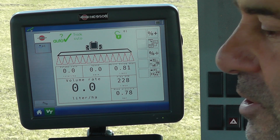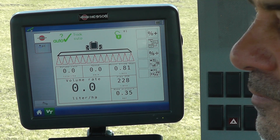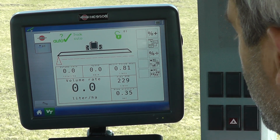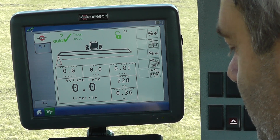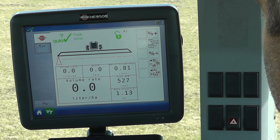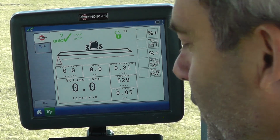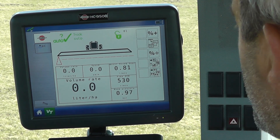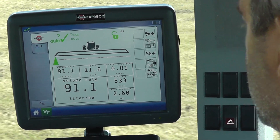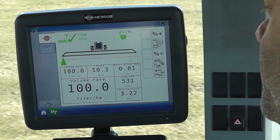For the last test I'd like to provoke the whole system by changing various things. I've stopped the tractor, I'll switch off all but one section, and I'll change the engine RPM. So I'm a bit over 500. Are you ready to count? Let's go. I've got about four seconds here. Try that with your existing sprayer.